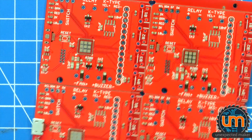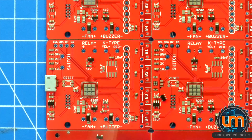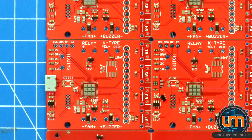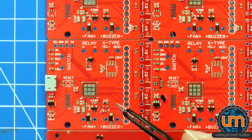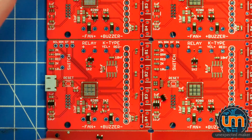I think vision is failing. I think the reason everything placed badly was because vision wasn't working, and when I rebooted it, vision started working again - that's the only explanation. So the vision is intermittently failing, maybe the camera is failing. Maybe this machine is not capable of producing that many boards. Maybe I've broken it further by actually building things on it. But none of this can be explained by a bad project file - not when it places badly and I turn the machine off, turn it back on, and it places good on the same file. CharmHigh should be totally embarrassed. Don't buy a CharmHigh, folks. Don't give them your money, don't support this. This machine is honestly a joke.